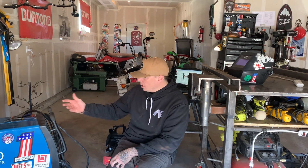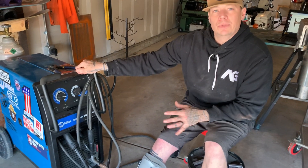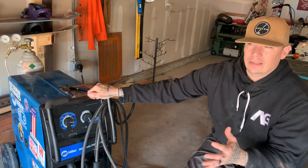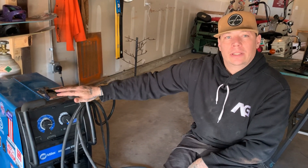Today I'd like to walk you through a really normal, run-of-the-mill gas metal arc — GMAW — MIG machine. The one I have right here is a Miller Matic 212 Auto Set. This is kind of a middle-of-the-road gas metal arc MIG machine, used for light to medium duty work. We don't have a lot of heat or a ton of voltage — about 22 volts is about the max you're going to get out of this machine.